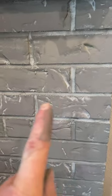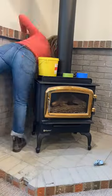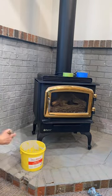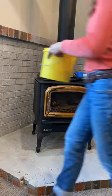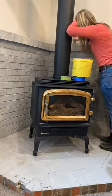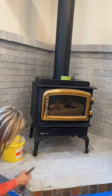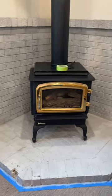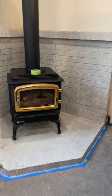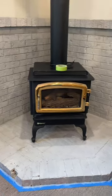That was the look we were going for! So I had to make some changes in my process — it was a learning experience. I decided we're going to go full on Silver Screen first and Gotham Grey over top. I went back and applied Silver Screen again — same one part water, one part powder. The Gotham Grey had dried so fast I didn't even have to wait. I just mixed it up and covered the entire brick fireplace with one coat of Silver Screen. This is what it looked like with just the Silver Screen — a little too light for what the customer had in mind.